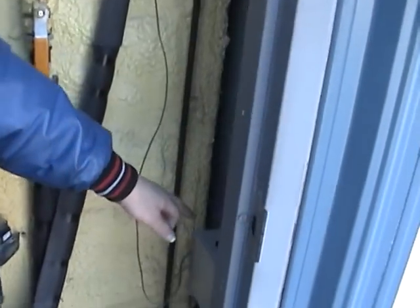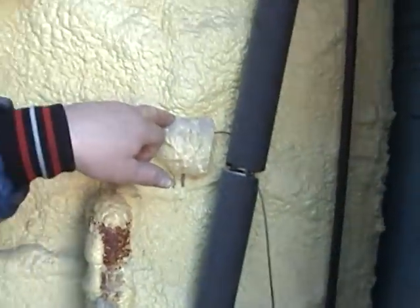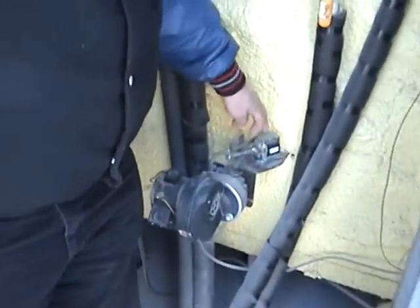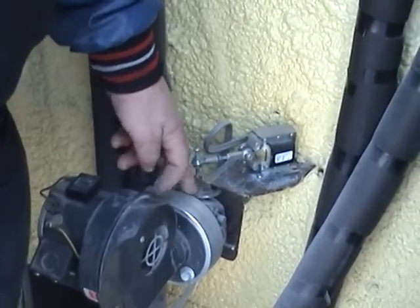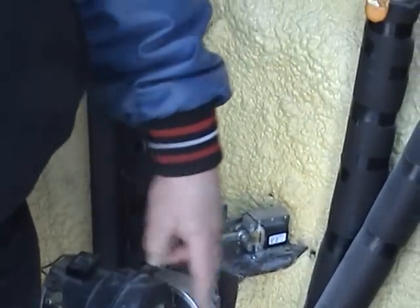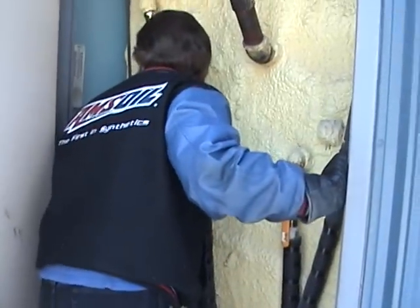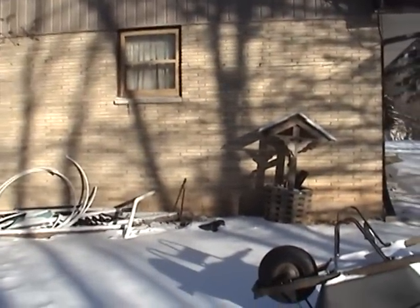Over here is my Wattlow set point controller. It's 175 degrees in the water right now, measuring off the side of the tank. When it finds 180 degrees, it shuts off this solenoid and this blower — the solenoid shuts off the throttle body, which is off a '92 Chrysler minivan, so the air can't go in. When the temperature gets down to 165, it turns right back on and cycles again. Right now it's 76 degrees in this room. The water travels underground, 33 feet to the house, and I only lose one degree all the way there.